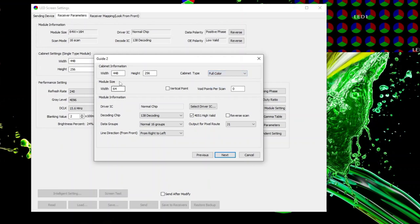This is the next part where I really messed up. It asks for your width again, and I put in 448 again because I thought it was just asking for the width again — but what it's actually asking is the width of each individual panel. Since I'm using P5 panels, each panel has 64 pixels across, so put in the width of how many pixels are in your individual panels. You don't need to put in the height for some reason, just the width — not the width of all the panels, just each one. So if you have P10 panels, put in 32; if you have P5 panels, put in 64.